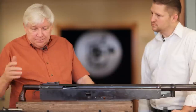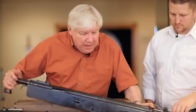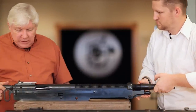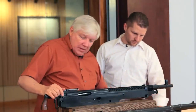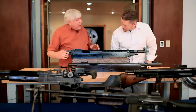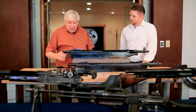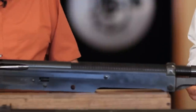chamber. Marlin came along at a later date and invented a gun that was made on the potato digger frame, but they used a straight gas system. And this straight gas system basically pushes directly on the mechanism, and they had extractors break. They had the cartridge case pull around it. So this gun was not satisfactory. It took special ammo and everything else to do it.